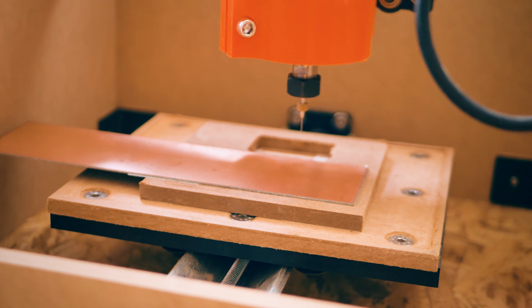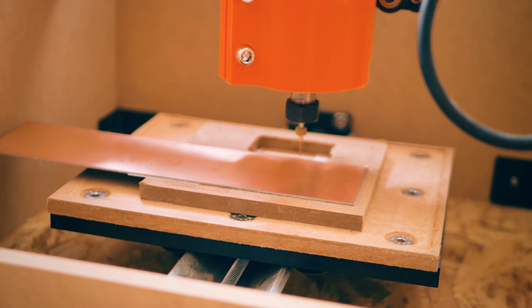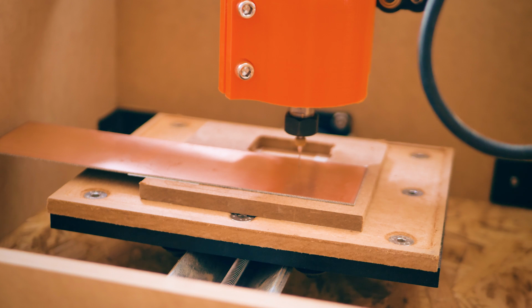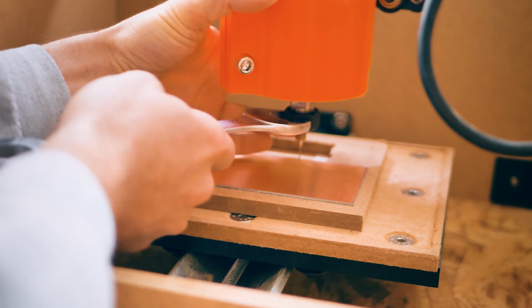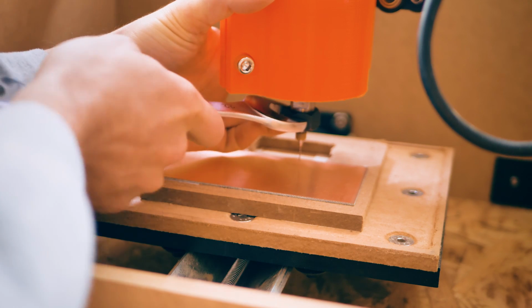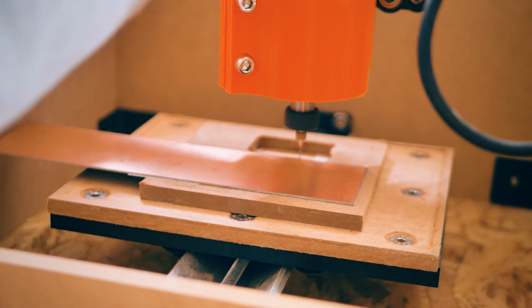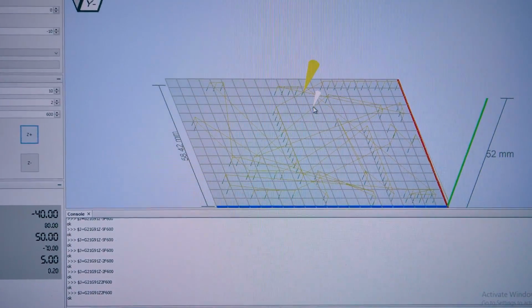Instead of using a shim or a piece of paper to gauge that point where the tool is just touching your workpiece, I instead left the collet on the spindle open, which means it's just grabbing down hard enough so that the tool doesn't slide out, but it's still loose enough so that I can just use the Z-axis and drive the tool into my workpiece, and the tool is just going to slide up in that collet. In that position my Z height is set perfectly and I can just lock down the collet like usual. I gotta say, this works incredibly well.